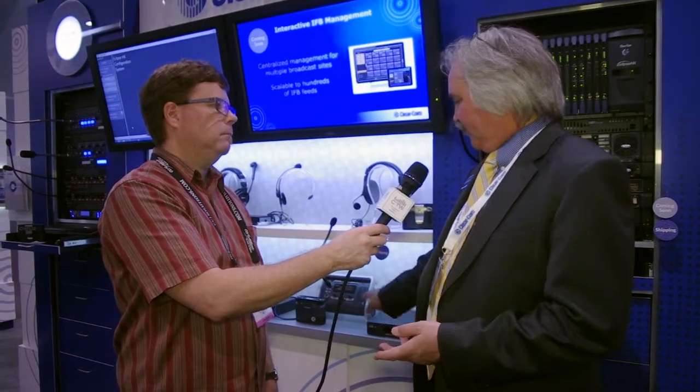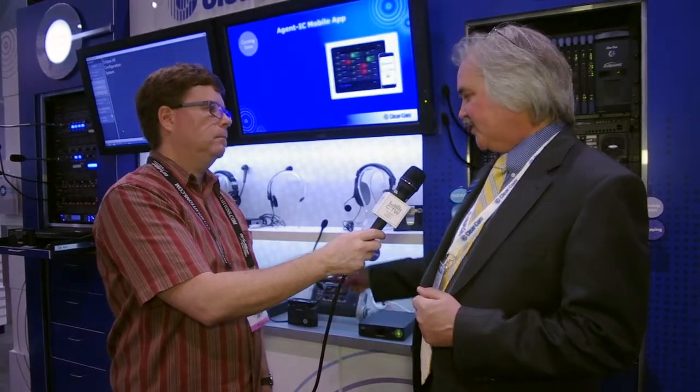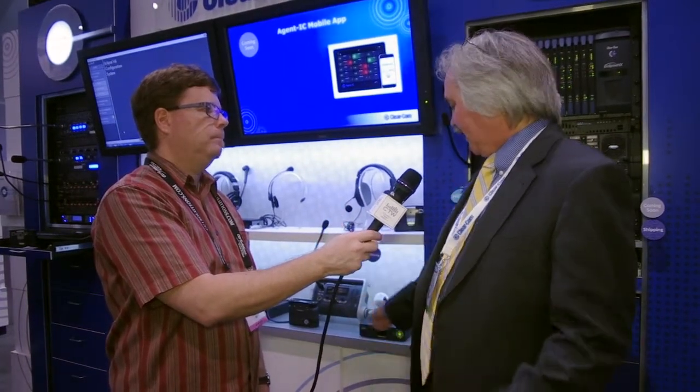If we can get on the internet, we can connect intercom. It's a two-channel device — channel A and B. The two-wire device is capable of powering five of our modern ClearCom belt packs — the 700 series — directly from the box, so no external power supplies required. If it's a larger system, we turn the power off in the box and use a main station to provide the additional power. The four-wire can connect into a matrix or directly to a base station with four-wire connectivity.